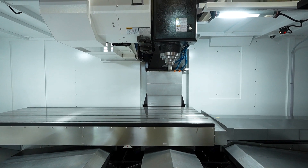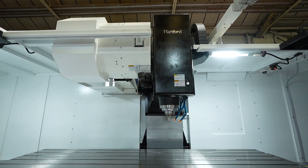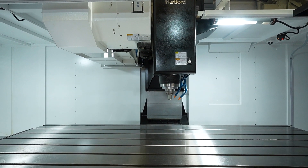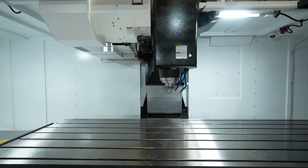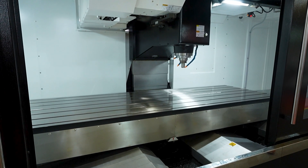There's always a bit of a debate between linear guides and boxways — there are advantages and disadvantages. But you can get the best of both with this machine. Hartford, on all the HCMCs, have a function called air suspension. They inject positive air pressure between the boxways, and to simplify the explanation, it reduces the friction or slip-stick effect that you can sometimes get under heavy loading on boxways. So it increases its dynamics and gives a nice transition between the two types of builds.